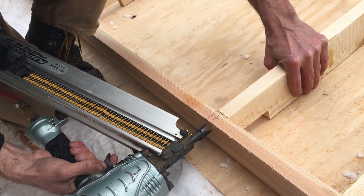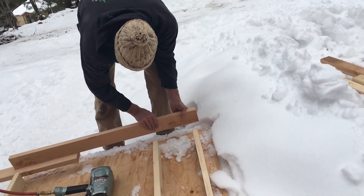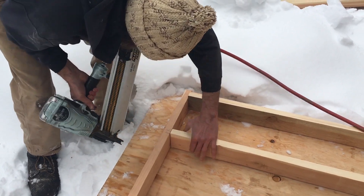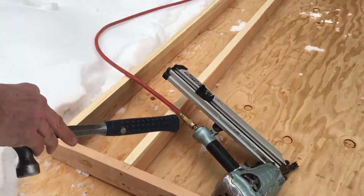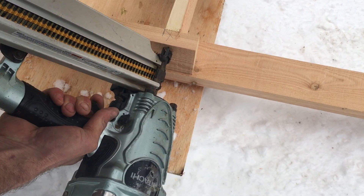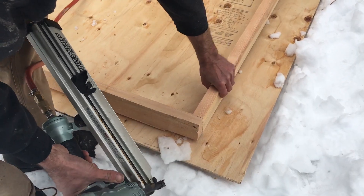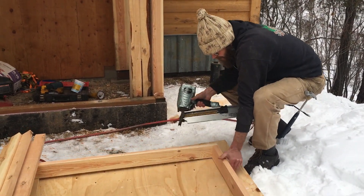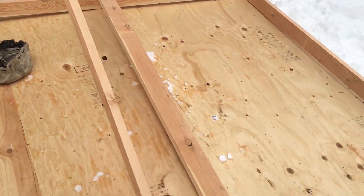You might notice that some of these boards look a little thin. These aren't milled to be inch and a half, so they're not really comparable to commercial 2x4s. I milled them at about an inch and a quarter, and that was in order to get more material out of each piece I had available. They're going to do the job just fine — like I said, this is not a load-bearing wall. The thicknesses vary quite a bit — not wildly, but I would say plus or minus an eighth inch. So sometimes when using this lumber I have to measure the thickness to take into account what the thickness is at any given point.